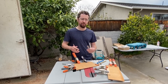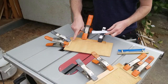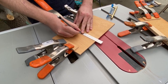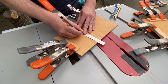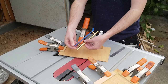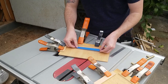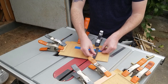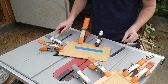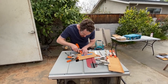Now I want to measure the distance from the bottom upward, like I did on the cabinet door. I'll measure the distance from this spacer — 3 inches — and then I also want to measure the distance away from the edge, which is 1¼ inches. So I need one of them to be right there. I'll take this piece of tape off of my cabinet pull, and then I'll line up one of these holes directly on that, and the other one I'll make sure is 1¼ inches away from the edge. Now I know exactly where I need to drill these two holes, and I'll use an awl just to make sure it's more apparent.